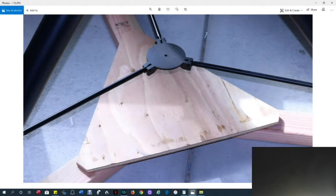Assemble all the boards and bolt them together under the tripod. As you assemble the dolly, put pieces of lumber underneath to prop everything up so there's room to stick a C-clamp under the bottom triangle. As you stack everything, be sure to center the plywood under the bracket between the tripod legs, and at the junction of the three 2x4s and the top plywood — make sure they're all centered. Clamp the upper and lower plywood and the 2x4s together so they don't move, then drill a mounting bolt hole a couple of inches from the center on each side. Do it on all three legs.